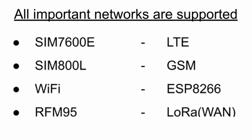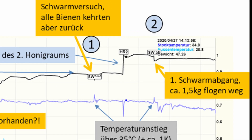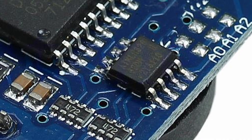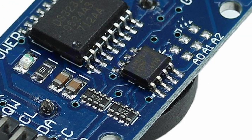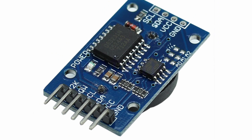In addition to Wi-Fi, GSM or LTE, LoRaWAN is also available for the B-Logger for data transmission. In connection with web server scripts, a swarm alert can be triggered via email or Pushover. This even works when a local EEPROM is used as a buffer for the data, in order to bridge short-term connection problems or simply to save power or traffic.